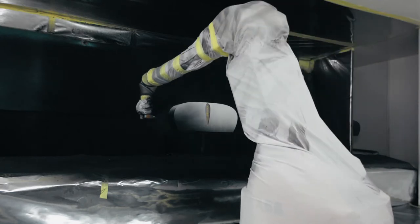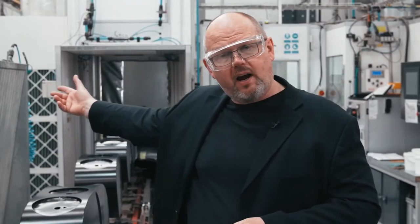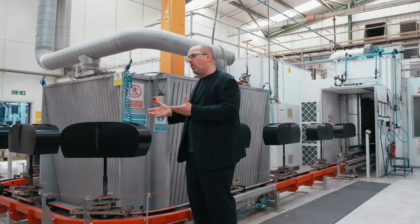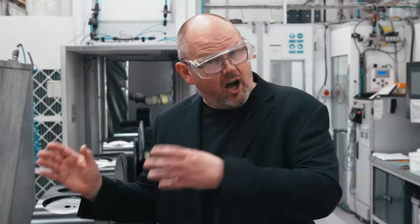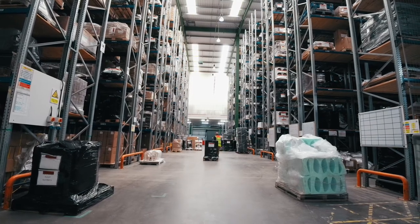Our paint process is applied by robot — we have an automated paint spray robot plus an oven chamber that moves the products through the paint process and then back through a stoving oven, baking them before they receive more coats of paint. The paint robot applies coats first, then we take them and 'flat' them back to get them really smooth and remove any surface imperfections, then they come back in to receive a further four layers of paint — eight coats of paint in total on this black model. After leaving here it will sit in our warehouse for two weeks to allow the paint to cure off and become really hard, and only then can we machine polish it.